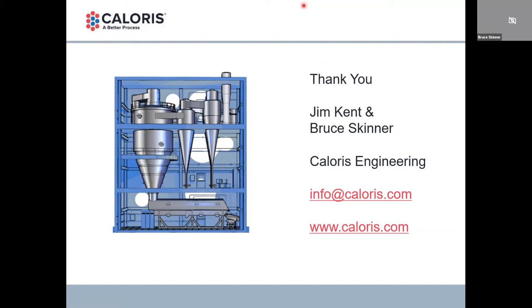What horsepowers are the turbo fans? That can vary widely. We have done a single-effect MVR with a 1,500 horsepower motor on the turbo fan, evaporating close to 100,000 pounds per hour of water. For us that became the limit primarily because of the size of the vapor separator. There really is a physical upper limit, but I'm not quite sure what that would be.